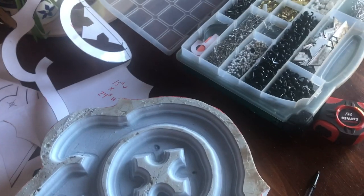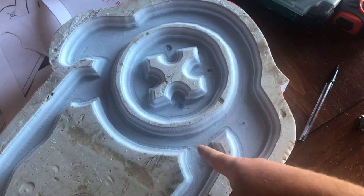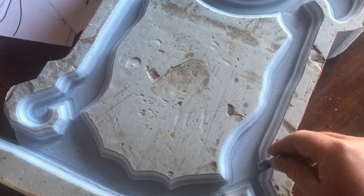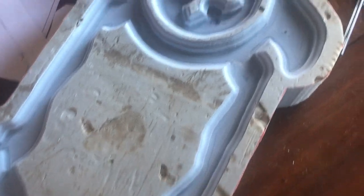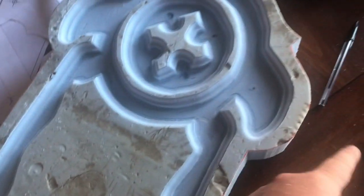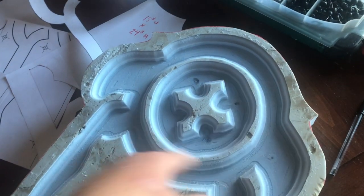The first thing I did is I used a half inch bit to clear out the material from this whole area. You'll notice that if you use a half inch bit according to my template this is too big — doesn't matter. Being such a big rounded bit you'll see that I rounded some of the points to get by. You don't have to be exactly specific. If the bit that you have is a half inch, use the half inch and just compensate as you go. This isn't an exacting science.